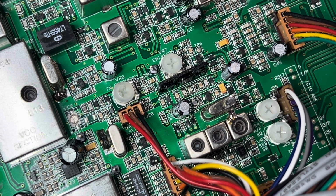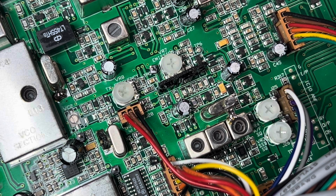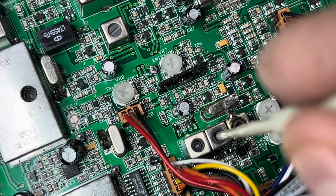All right. Switch your radio to lower sideband. Make sure you're on frequency. And again, this is not an alignment. This is for people that bought this radio and can't use it because as you heard it, it's not usable. So now we're on lower sideband. Lower sideband is the middle trim pot. We're going to go into there. We're going to key up.